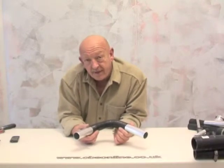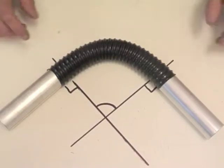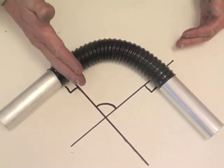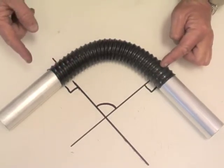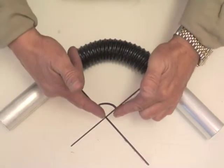To make a neat and tidy job of your plumbing, it's often important to know the bend angle and bend radius of a piece of hose or pipe — and this is an area of confusion we often deal with on the telephone. I'm going to explain it using this piece of ducting and two 38mm short lengths of aluminium tube. I've laid the components out on the bench and marked two lines that are tangential — that's 90 degrees to the hose — at the point where the bend starts and where the bend finishes. I've extended those lines to a point where they cross.